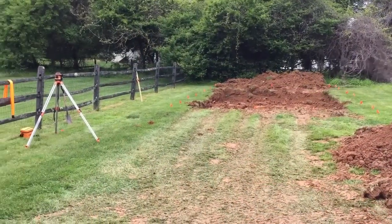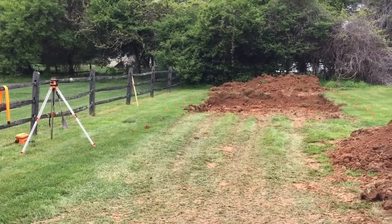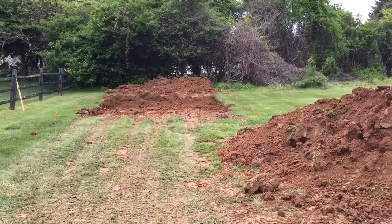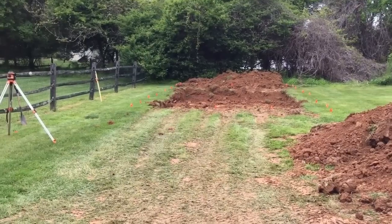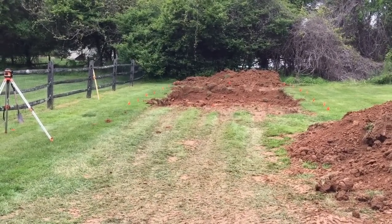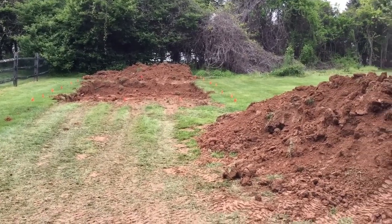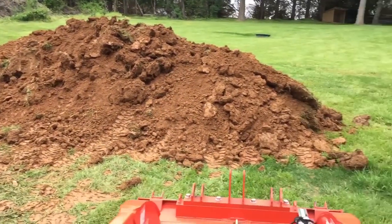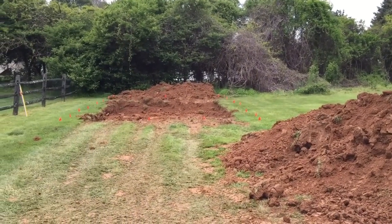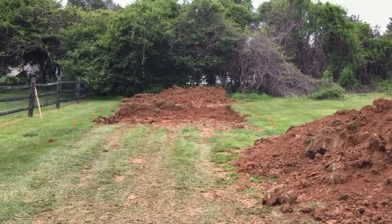Alright, here I am digging. I got the rotary laser level out to help try to keep me on grade. It's high on the right side here, so I'm taking a lot more dirt over from there, and then obviously the left corner closest to us is where it's the shallowest, so I got to go a lot deeper in the far right hand corner. And there's piles of dirt that I moved so far. So I'm getting there, slowly but surely digging this hole out to put the pool in. So, see you soon.